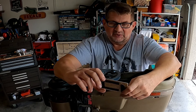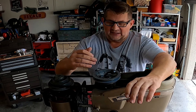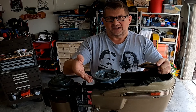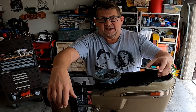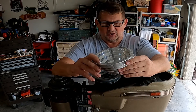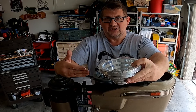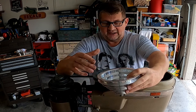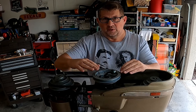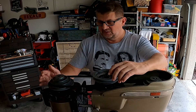So I have a bunch of speeds that are all kind of clumped up onto themselves, and it really in the end only allows me to use about three good speeds: 240, 520, and 930. I use those the most. Thinking about it, I got an idea — if I added in a five-sheave pulley in the middle and always kept the lower one in place, would that give me better spacing in speeds? So today I'm going to remove this, move the motor up to get that top sheave, and we'll have four to play with on top and three on the bottom.